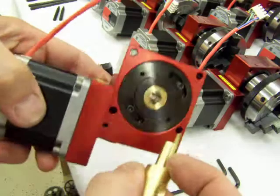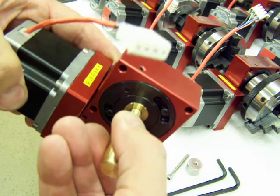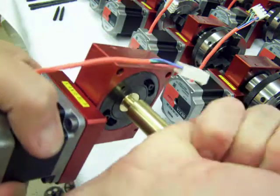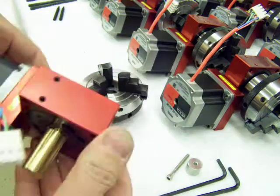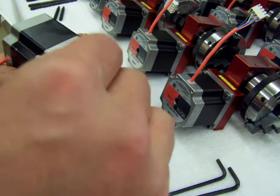While holding the key I'm going to line it up with the keyway and then start to push it in. I'm going to have to tap that with a piece of wood, get it almost all the way up there, and then put the bolt through the back.